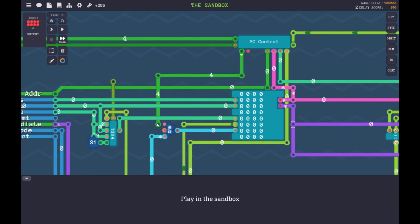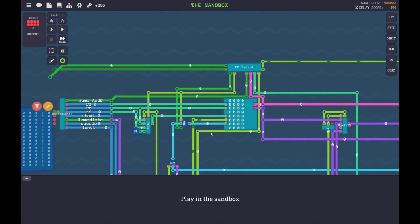Move this down there. Actually, that was wrong. There we go. Because when the link pin comes on, that's when we want to switch to using the link address. And then this last output is the link control. So this output tells us if we're doing a jump and link or a jump and link register instruction, and that just controls these 2 multiplexers like I mentioned earlier.